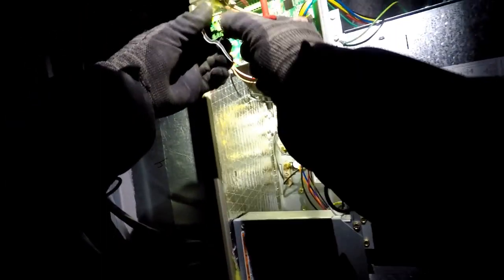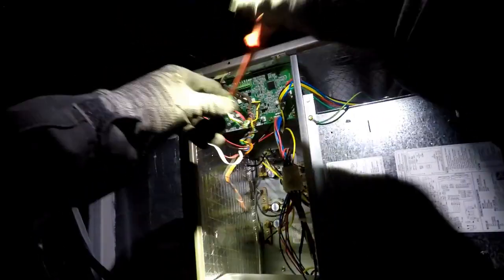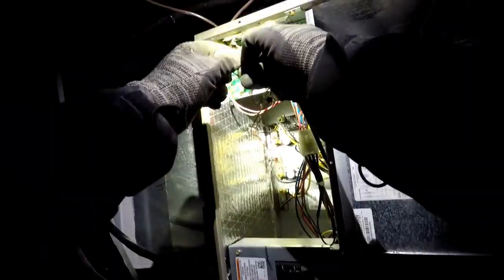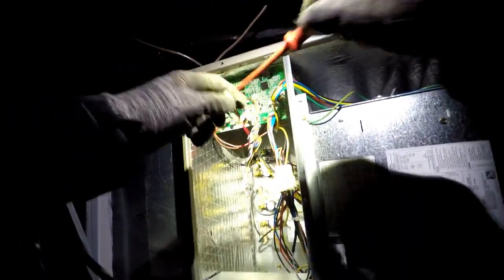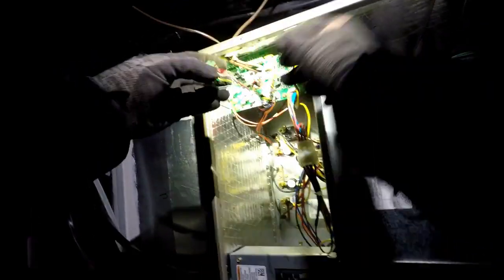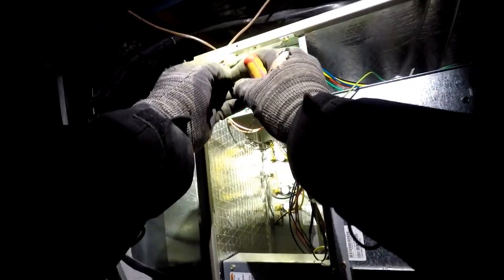When you hook these wires up too, you don't want them stacked on top of each other under the screw. You want them side by side, not like this. Super important for a good signal. You're not supposed to ever put more than two wires under one terminal. The signal on these, especially in this case our black and our orange, which is really our yellow and green, is a really sensitive signal, so it has to be as good as you can get it. They don't even allow any splices or anything. You're supposed to have a solid wire all the way. And they tell you not to put any more than, again, two wires under each terminal, side by side, and so on.